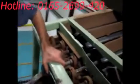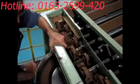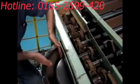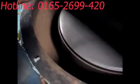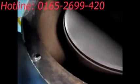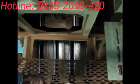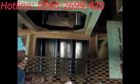How does this cracker work? Well, this cracker works by a drum that's spinning in the middle. As the walnuts fall through, they fall through a tighter and tighter spot until they're cracked. That is really interesting. They'll fall down onto another set of sizers straight down below. If they're not cracked enough, they'll go through a secondary cracker that way. If they're already cracked, they'll fall all the way through those sizers.